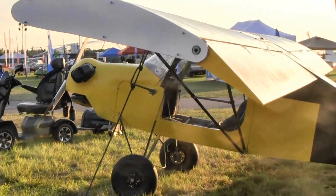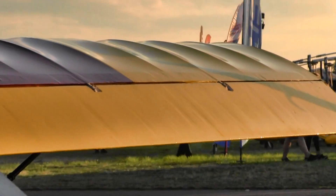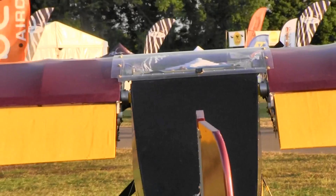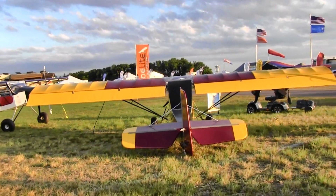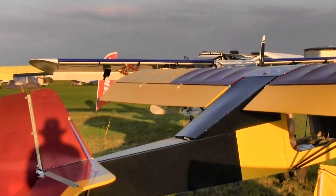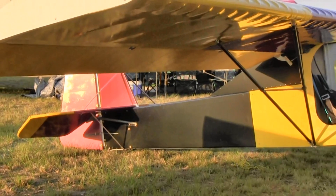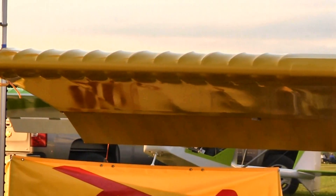This aircraft was designed to be a STOL — short takeoff and landing — airplane, achieved through technical innovation. It features a new airfoil enhanced to produce better lift at low speeds. It also has unique full-span, huge ailerons or flaps — they really are big — which cranks up the coefficient of lift. James has already demonstrated a 30-foot landing at gross weight, which is about one and a half times the length of the airplane. That's very short.